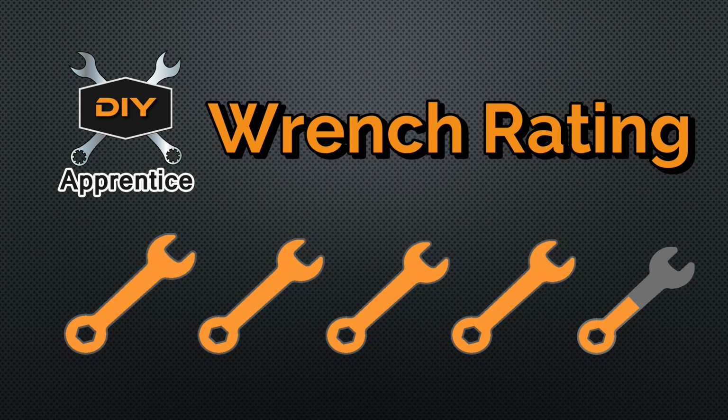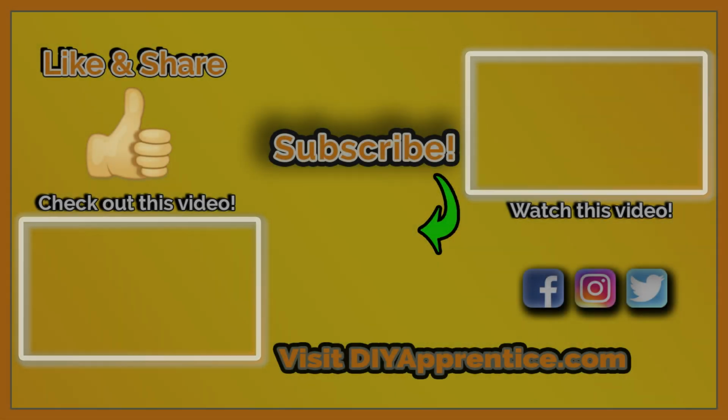A couple minor negatives of this tool are that the screw shearing feature doesn't seem to cut cleanly and causes a slight bend at the end of the screw. Also, the cutting blades are a little beat up, but they still function just fine. Overall, this is a much better tool than my old wire cutter and stripper tool for electrical wiring projects around the house.